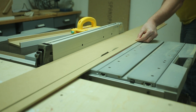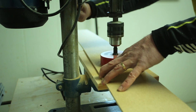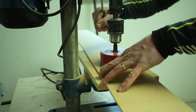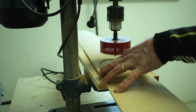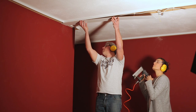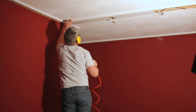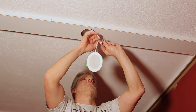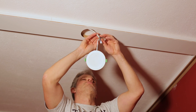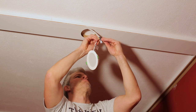The 5mm HDF plus the 2.5cm sides gives us the 3 centimeters clearance we need. Then I cut the holes for the actual light installation — the recesses just need to be in the ballpark, but I want the cap holes perfectly centered since we're going to see these lights. A quick couple coats of paint, then more glue and the same 15mm brad nails to tack the caps in place. Time to wire up the lights — I actually checked them before securing the caps, I just forgot to film that part. The caps are on all the beams, the lights are installed, and they work.